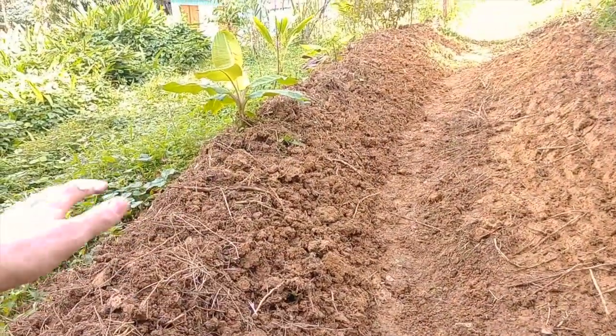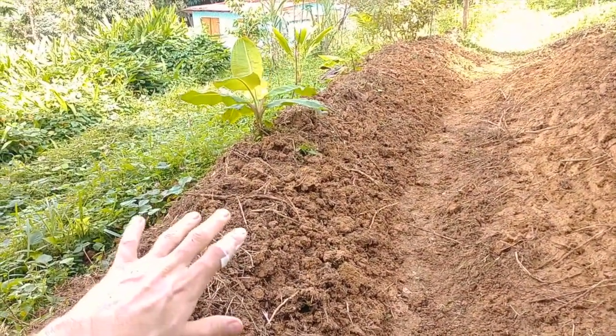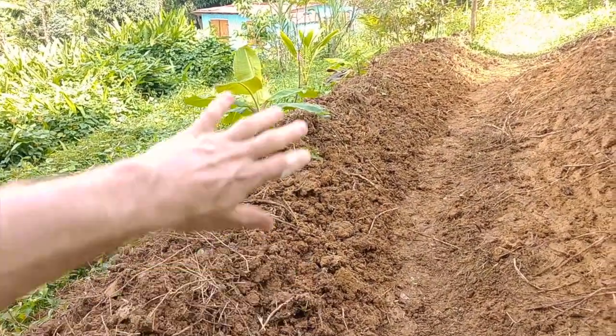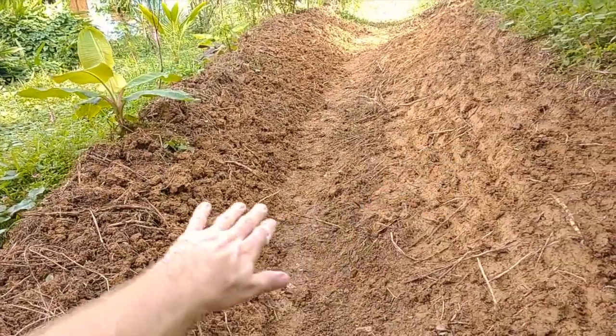You can see this is a nice large uncompacted mound. We're not compacting it into a certain shape — we're just throwing it on loose and then slowly helping it become a natural bowl shape. The reason you do that is because naturally, as the soil starts eroding a little bit with the rain flows, it's going to start to slump and make kind of a bowl shape — like the side of a bowl. If you naturally put that in when you start the work, it's less likely to erode long term, so we're trying to put that in right from the beginning.